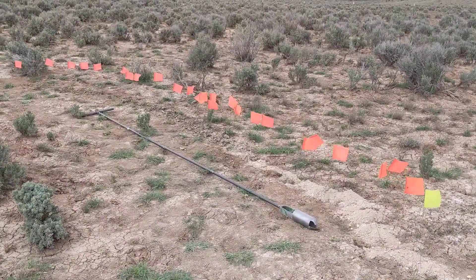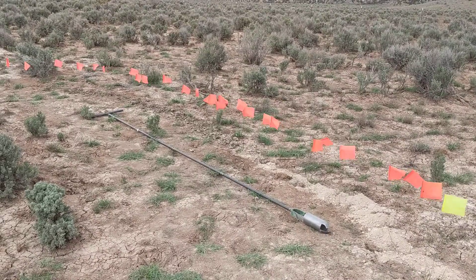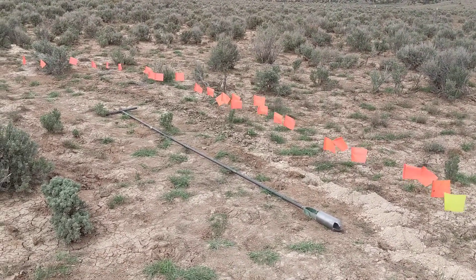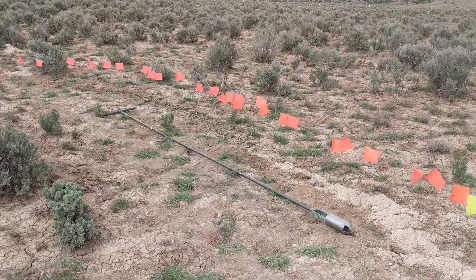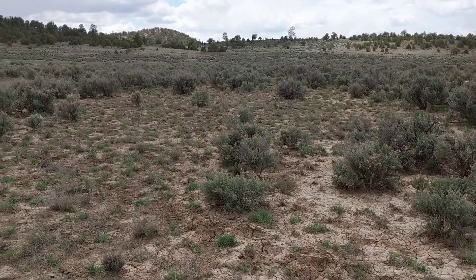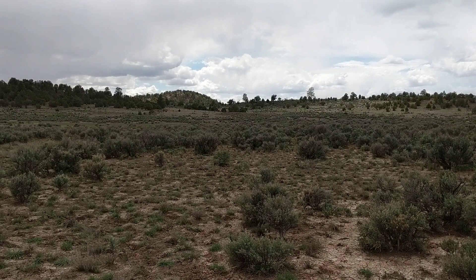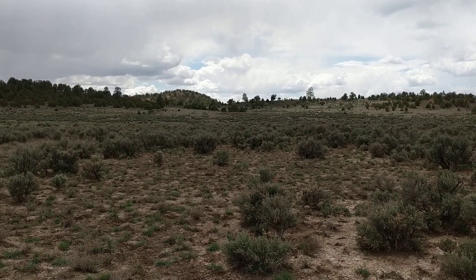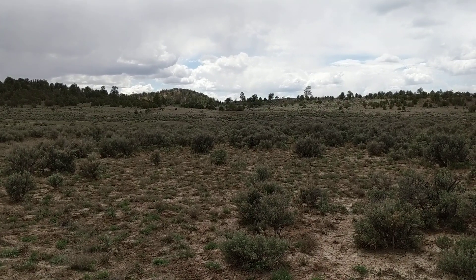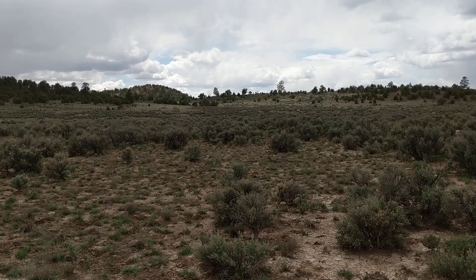We're here in Cuba, New Mexico. We laid out a pond and we're going to be building some gully plugs in a sediment basin. There was one pond we had in question due to the differing types of soils in this area. If you look at that pond, there's a pond that already exists right there. The producer built it but it doesn't hold water — it's actually on a gravelly loam. And so that's why it doesn't hold any water.